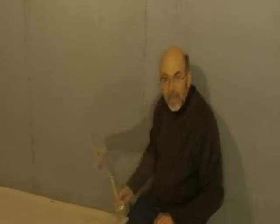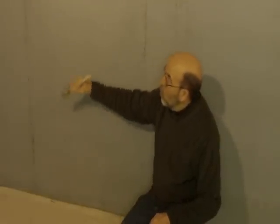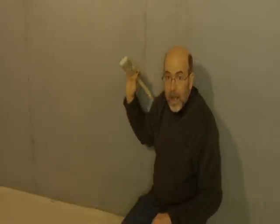Just like in any project, the first thing you want to do is have a system. What I do in painting is do a cut-in. Cutting in is simply framing out the areas that you want to paint within. My cut-in starts at the floor — I will paint the wall at the floor, go up the walls all the way around, and then fill in the rest.